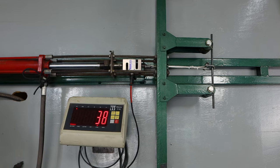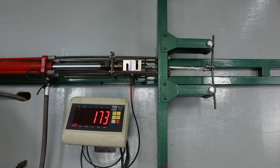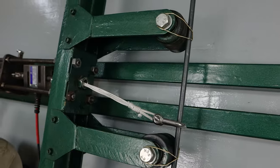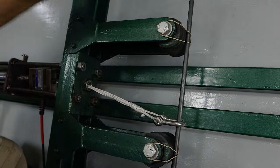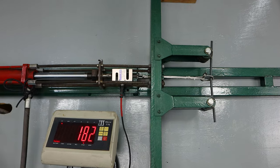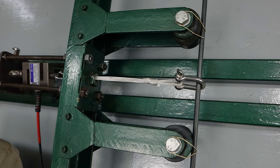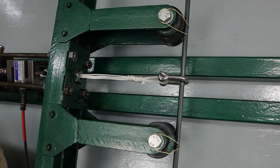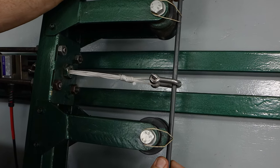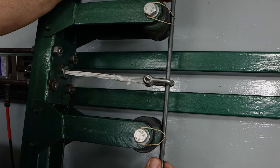We're always pulling more or less in the same place. That was 150 — let's take it up to 160. The dyneema should be okay at that. Wasn't watching — over 170. Back it off. Still nothing at 170 — wow, even I'm impressed. Okay let's take it up to 180. Just over — nice deformation. Back it off. I'm feeling a slight variation; one way or another it seems to have a slight bend. Definitely a slight bend — so that deformed at 180.